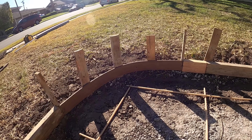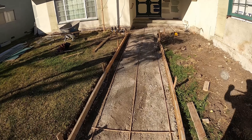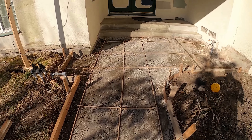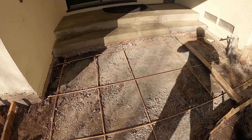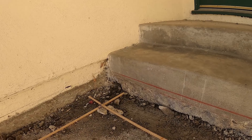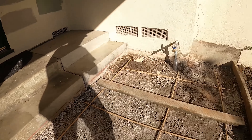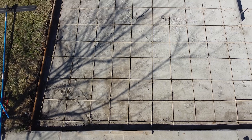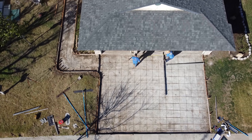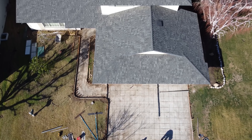That masonite normally comes with a green plastic wrapping — you can get it at Home Depot. I just tore the green stuff off and went with straight masonite, no protective green fabric. We also had to shorten that step up a little bit, so we don't have perfectly equal steps anymore — but it's very close, within about three-eighths of an inch. I had to do that to cover all of the cracking along the base of that first step and get more slope to the front.